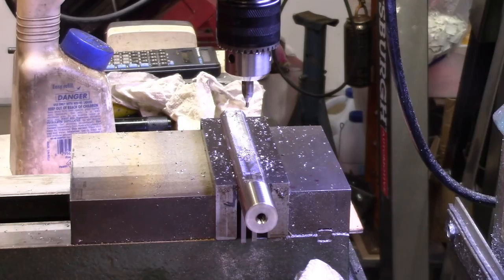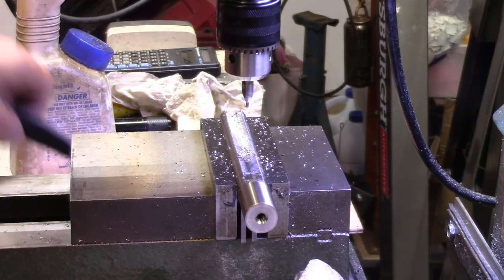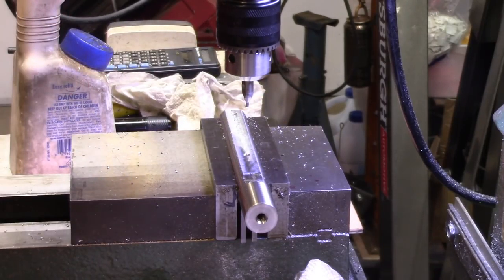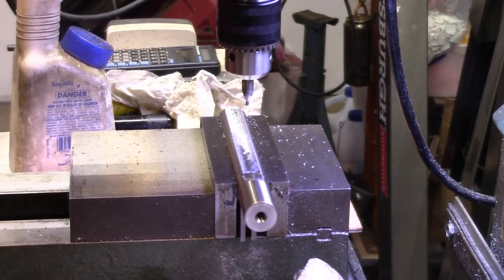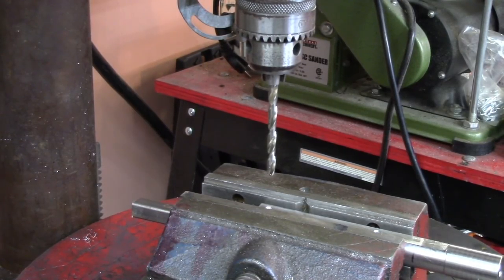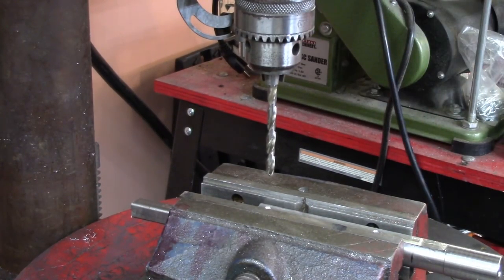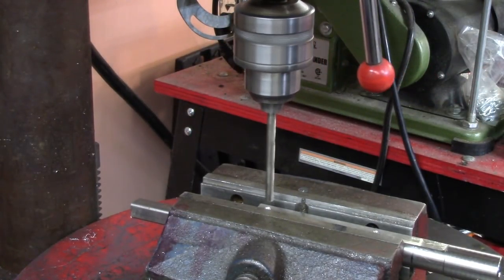All right, now all I've got to do is take it over to the drill press and drill the holes. They've got to be this size — I think eight millimeter — so I don't have metric drills but I've got drills that are pretty darn close. No precision required here anyway, so we'll just find a drill that's close and drill a couple holes. I stuck a piece of sacrificial metal underneath here and I also set the drill stop so it won't go all the way through. You can get sacrificial metal at the sacrificial metal store — special stuff, it's all been blessed by Tom Lester.